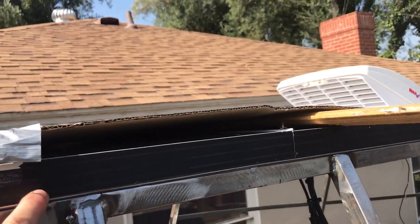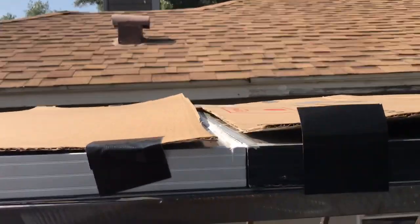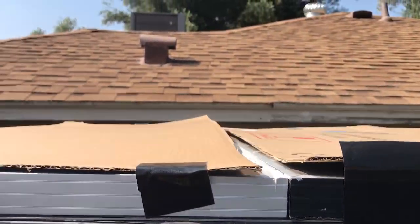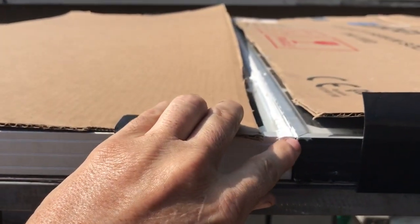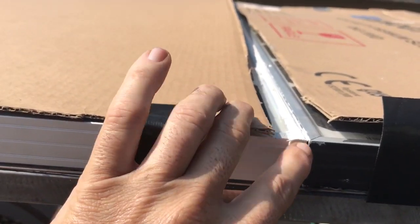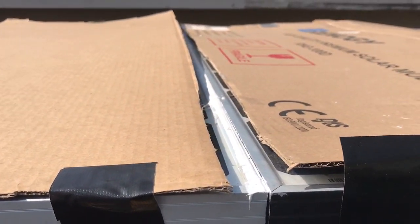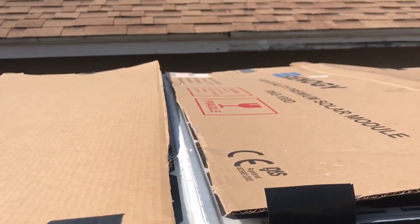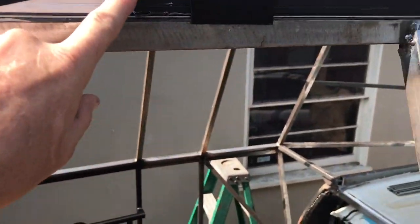These two are physically screwed together because they're the same size and this one's just slightly different. I used the 3M 5200 series sealant for marine — it's considered a permanent sealant. It takes a full seven days to set up and I got the front and around the other side and then back here all sealed, but I basically ran out when it was time to do this side and a couple of the seams.